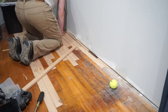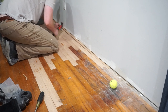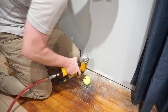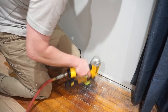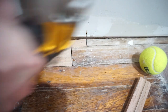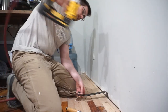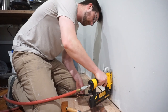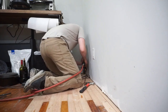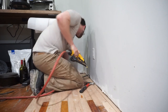You'll notice that the way you work has to change the closer you get to the wall. When you're down to the last three or four boards, the pneumatic hammer isn't going to fit on the edges anymore because the wall is in the way. Closing your seams is going to be harder and you'll have to find another way to fasten down your pieces. In my case I used a combination of screwdrivers and nail bars to pry the flooring together while I hit it with a finish nailer. I would like to hear in the comments if anybody knows how to properly finish around the edge of a room — I found so many different answers, and if there's anyone in the industry please let me know.